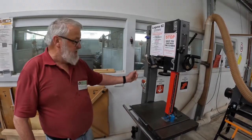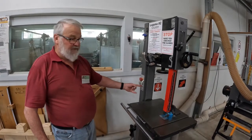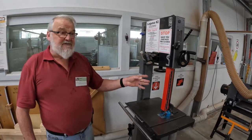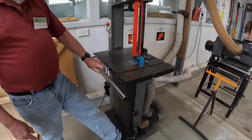Turn off the emergency stop. That, together with the on-control and off-control, will stop the saw. However, the blade will keep running because of inertia in the wheels. To stop the blade, the quickest way to stop it is to use the foot brake.